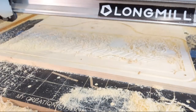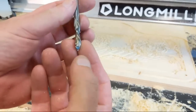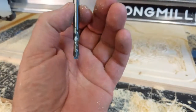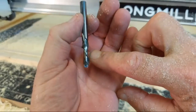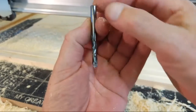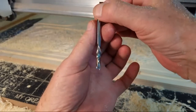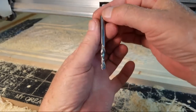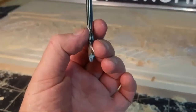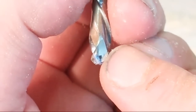All right, so we are now going to the quarter inch down cutter. I'm sorry, I'm going to use the compression end mill. So this is a compression here. And I'll explain the compression real quick. The compression has a down cut area on it. On a focus camera, get some light up here. When the router bit is turning like that, it's got a down shear action, which keeps the top side clean, prevents tear out. And at the very bottom, a little messy, but you can see there's a back cut right there, or an up cut area.